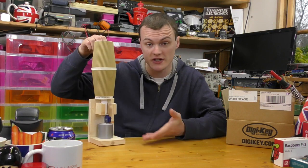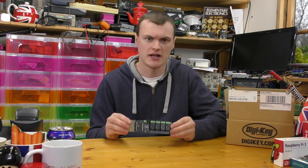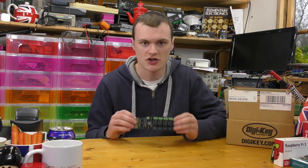You're going to need to find things to control with your butler system. For example, you could use an automatic sweet delivery system, or you could use mains power devices with the relay shield. There are a few things I should mention about mains powered electrical devices: don't do it unless you're absolutely competent. Mains voltage is incredibly dangerous. There are protection methods such as circuit breakers and RCDs, but if you're not fully competent and don't follow correct safety procedures, you could have a serious incident — electric shock, a burn, a scar, or even death.